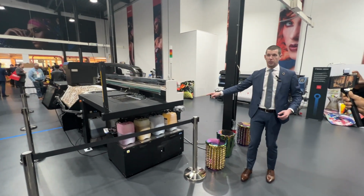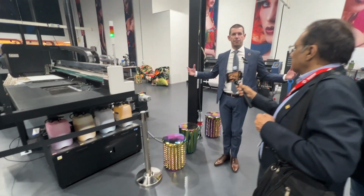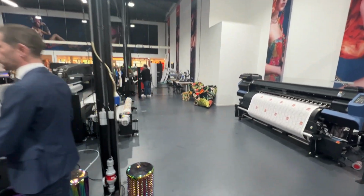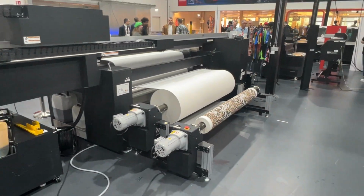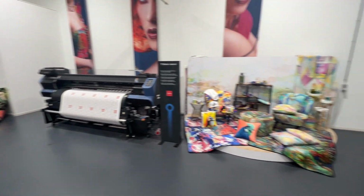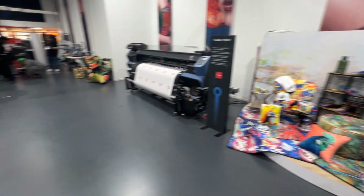It returns from the bottom, which is where we have the dryer, and then it actually takes up on the back side again. So the machine design itself is much more compact, and also we don't have to keep a lot of space on both the back and the front. If we have enough space on the back to deal with the materials, the front side we only need to keep enough space for the operator to check the print quality. So with the machine size plus the reduction of the space, we can save almost 4 meters in the depth requirement of the machine installation space.